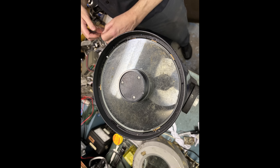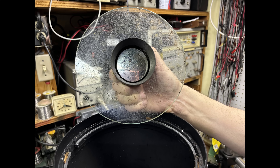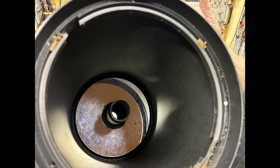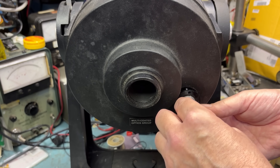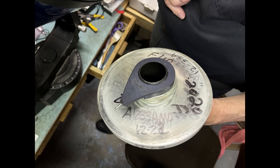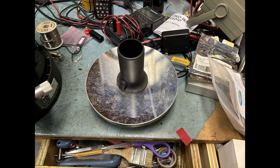There's usually an orientation mark on the plate put there by the person who assembled it, but if yours doesn't have one, mark it yourself so you can put it back in the same position. That's dirty — I'm especially concerned about the condition of that secondary, it does not look good. It appears that since the visual back was left open, a critter of some kind crawled inside and made the telescope its home. In order to remove the primary mirror, you have to take out a retaining ring inside and remove the focuser from the outside — be careful, there's a linkage on the focuser that moves the mirror and it's easy to lose that part. The front of the mirror — yikes. Whatever lived there left countless marks on the surface from scurrying around.